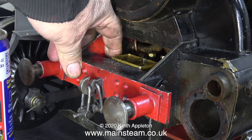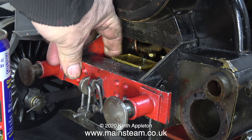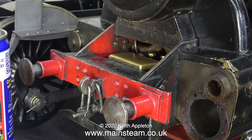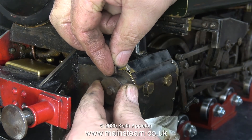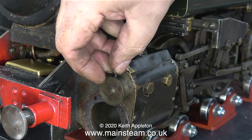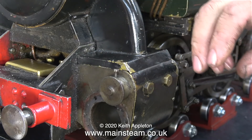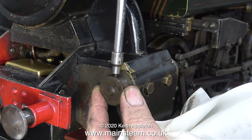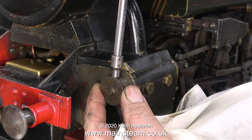Both of the pumps appear to work. I'm rotating them manually with the wheel on the end to get some more oil into the cylinders because very shortly I'll be trying to run this engine. Time to fit the cover on the end of the piston valve chamber — this is held in place by one bolt, which is all it needs. It's a very low stress component, just to keep dirt out of the piston valve area, and it doesn't need a gasket because there's no steam pressure at the other side.